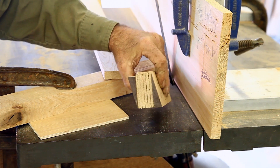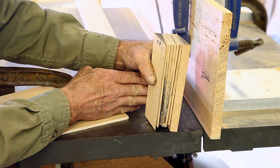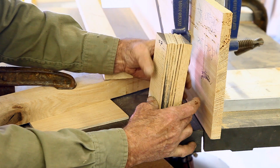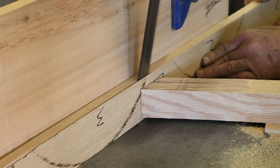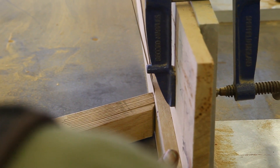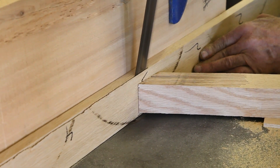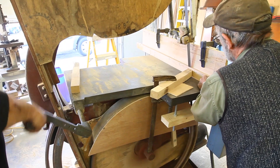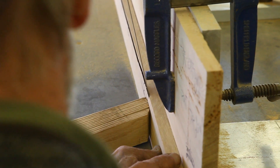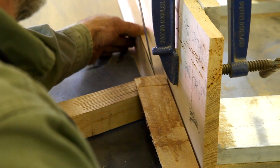That assembly goes into the boat with the thicker part aft on the starboard side, so the forward and after faces are directly athwartships and the inboard and outboard faces are parallel to each other, the outboard side laying tightly against the plank. We've got the bevels written on the frame, and as it goes by the saw blade I'll be calling those numbers out to the man on my left, who cranks the arbor over to that degree. He's paying attention only to his degree readout and me calling numbers — I'm not watching him and he's not watching me. That's what's required: he's got his duty, I've got mine. The bevel changes because a different bevel is required at every position along the frame — the top has very little bevel, there's more toward the turn of the bilge, and quite a bit less at the bottom.